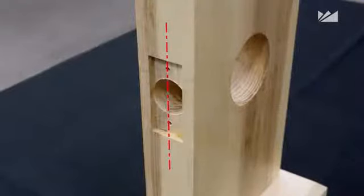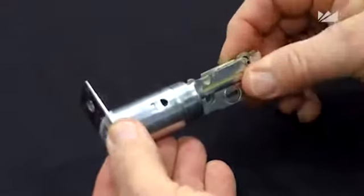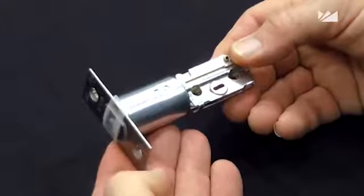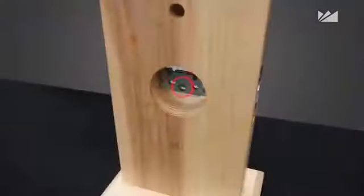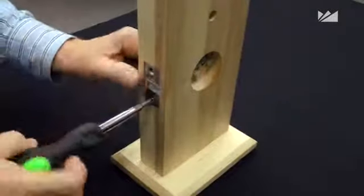The 1-inch 25mm hole is on the center line of the door thickness. Mortise the door edge for the deadbolt faceplate. The deadbolt is preset as 2 3/4 inch 70mm back set. If required, adjust the deadbolt to 2 3/8 inch 60mm back set. Install the deadbolt in the door with the 2 screws. Make sure the slot is at the bottom and the tape is still over the deadbolt.